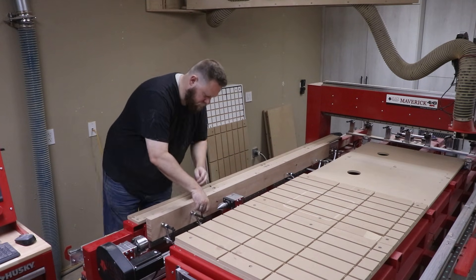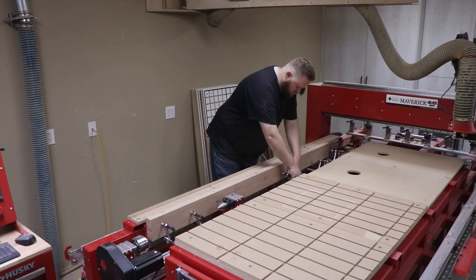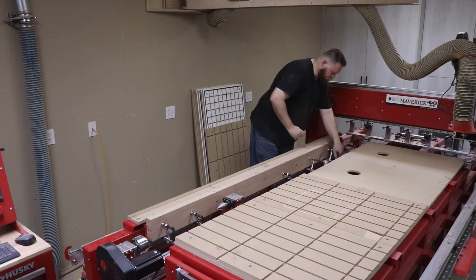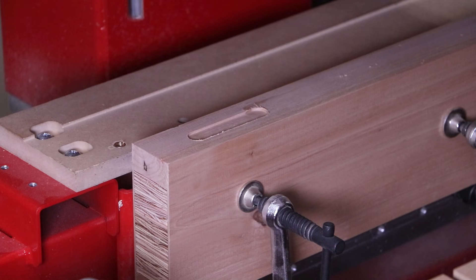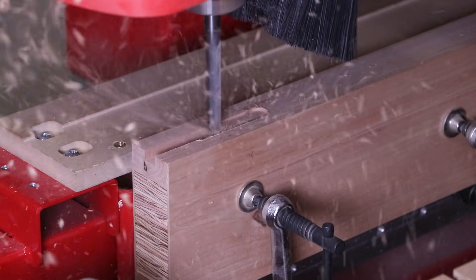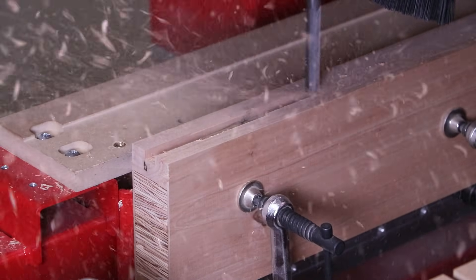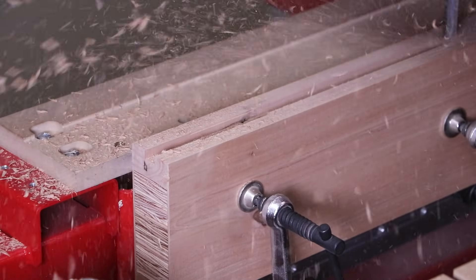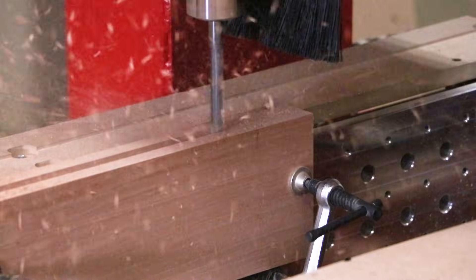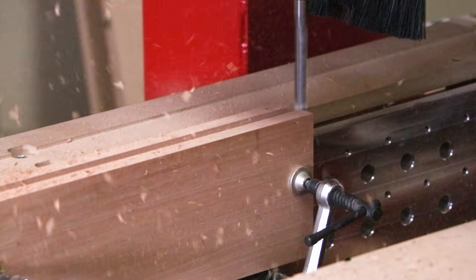My name is Chris Anderson, I'm with the Legacy team, and I just want to share with you some of the value I got out of doing this door for myself while relating some of the problems I ran into. This is all done using Legacy's Maverick 4x8 CNC system using three different workstations. We actually have the vertical workstation running along the length of the machine along that turning channel so that we can work on the long edge of our styles for the doors.